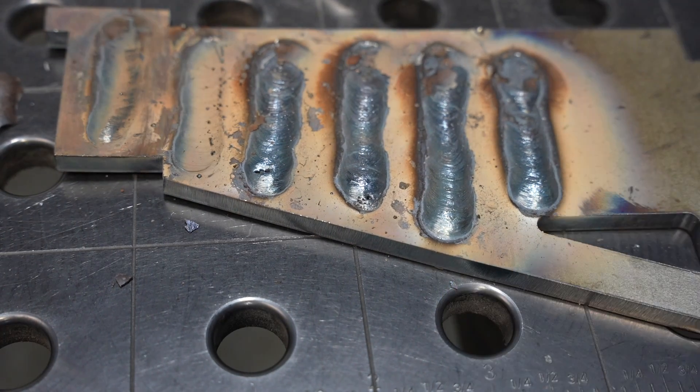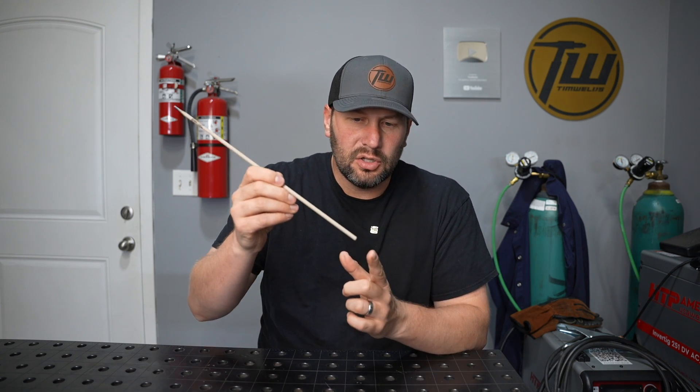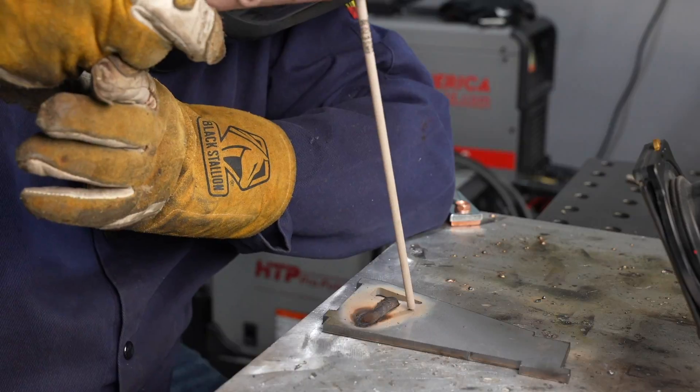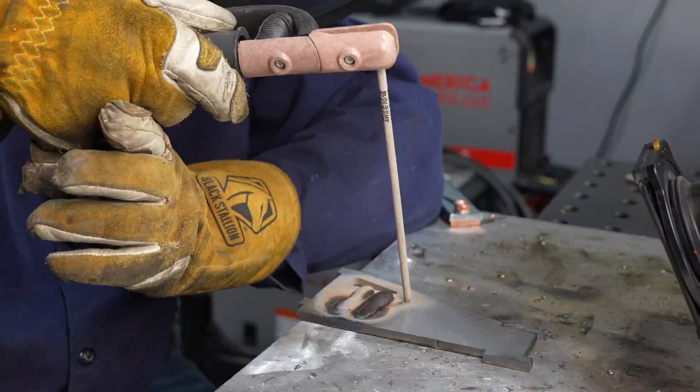The second issue is porosity, which happens due to a lack of shielding. You can end up with this at the beginning because you might not have enough flux — you might have chipped off just a little bit too much. The way to prevent this is to strike your arc up ahead of where you're going to begin your weld, then get down in close while you move back. By the time you get to the start of your actual weld bead, you're in position, you've melted back to your flux, and you're ready to go. Then you just burn over that little bit of strike. You might argue you're risking a slag inclusion, but it's a very small amount deposited and I think that risk is low.